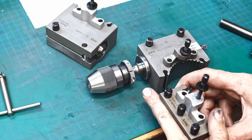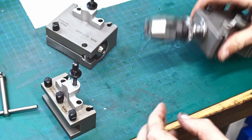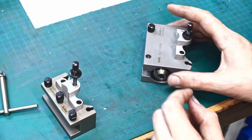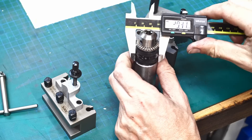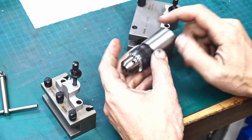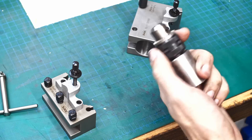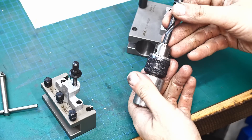What I didn't like about that setup was the large overhang when switching from a turning tool to the tool post drill chuck — you have to move the carriage quite a bit. Also, it's quite heavy with all that added mass. So I thought: let's get a small 0-to-8mm keyed chuck and put it inside a boring bar holder. A keyed chuck of that size is about 29-something millimeters in diameter, so it fits in the boring bar holder without interference. I then planned to make a 30mm diameter shank to be held inside the boring bar holder.